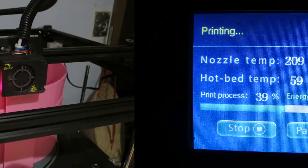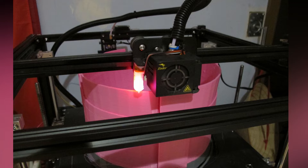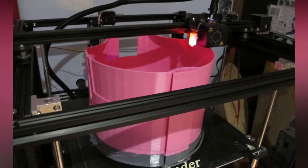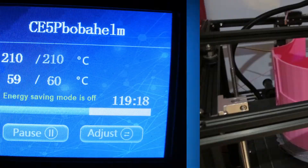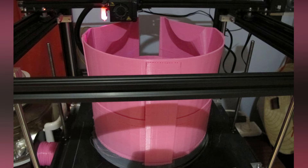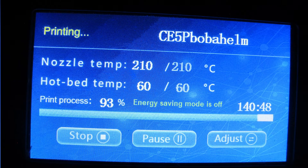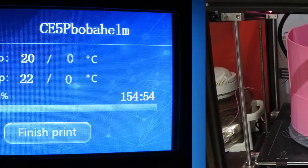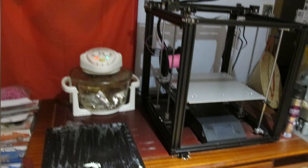Playing around with the slicing settings gets drastically different results. In large helmets, no two are the same. Leveling the bed is absolutely essential in getting that nice flat amount of plastic oozing around the nozzle. I did it upside down to eliminate supports and it came out to around 1 kilo 200 grams over 6 days.